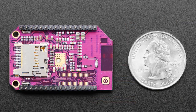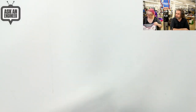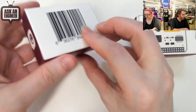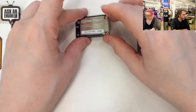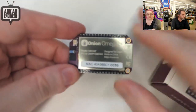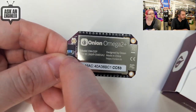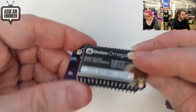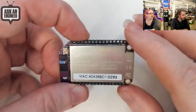Let's talk about that core chip — the Onion Omega 2. It's based off the Linkit chip — basically an OpenWRT-runnable chip. It runs a version of OpenWRT. It's kind of in between a microcontroller and a microcomputer — it's got a lot more power than your Arduino or CircuitPython because it's actually running Linux inside. It also has Wi-Fi — there's a little onboard antenna. There's an SD card slot, and it comes with some built-in flash and memory: about 64 megs of flash and 128 megs of RAM.